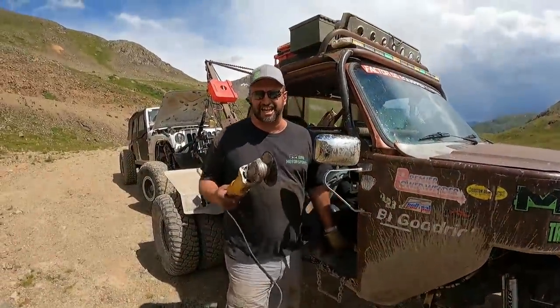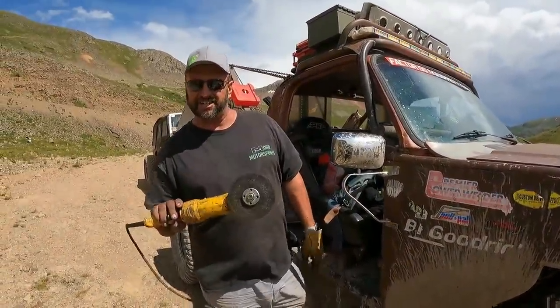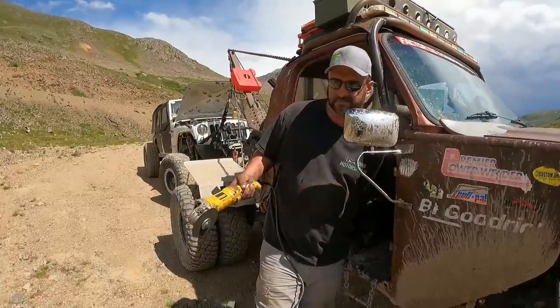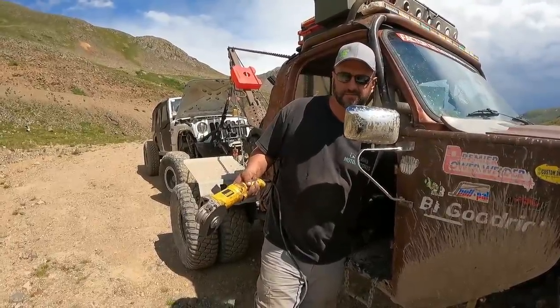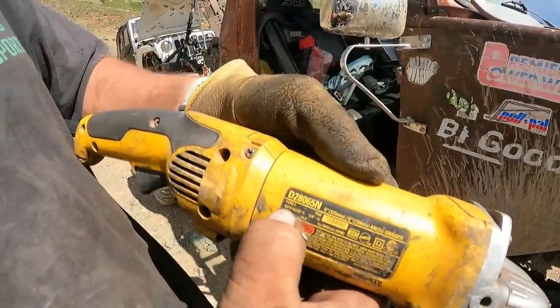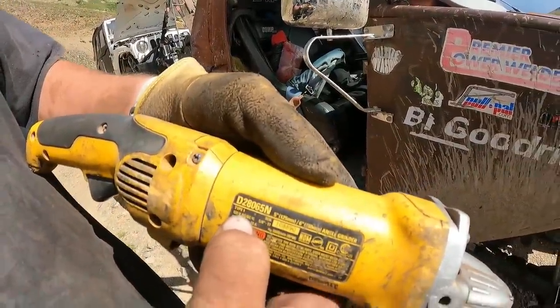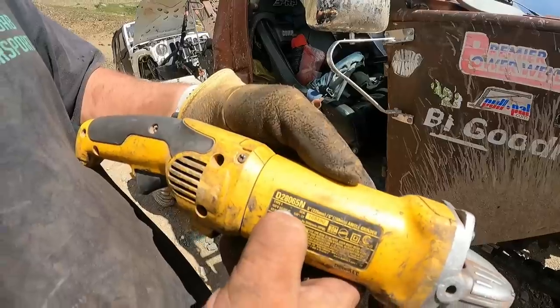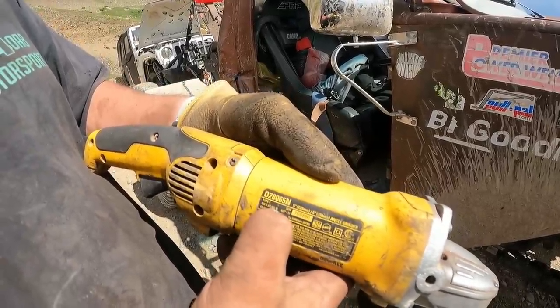The difference between a DC and an AC grinder is that an AC/DC grinder can run slower. AC/DC — 120-volt AC/DC. If it has the straight line and the wavy line, that's what you're looking for. DC is the straight line and AC is the wavy line.